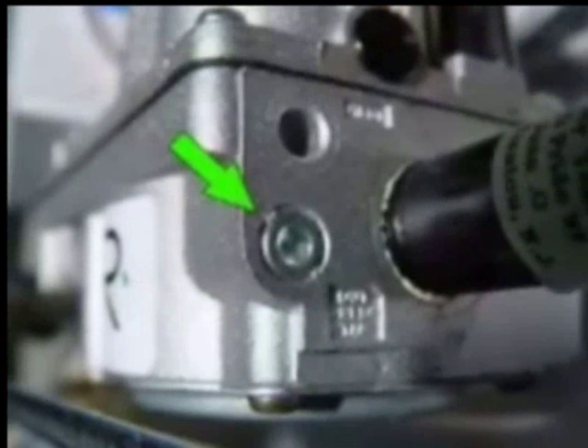The gas valve has a pressure port tap to measure the manifold pressure. There are two adjustment screws to raise and lower manifold pressure for first and second stage fire rates. The first stage adjustment screw is on top of the gas valve. The second stage adjustment screw is next to the pressure port plug on the outlet side of the gas valve.